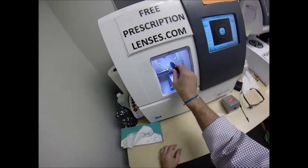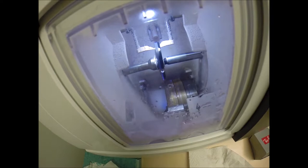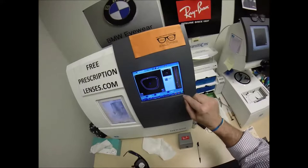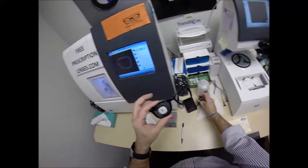Now that the right lens is in, I'm going to flip that over to L, press that on firmly, and just go one step smaller. The door closes, the clamp shuts. The lens is going to be traced by two white styluses. It's going around tracing the left side to know where to place the bevel. You have the least amount of edge thickness showing — even though I moved it back, part of that is I don't want a white ring around the lens from the safety bevel. If any portion of the lens sticks out from the front you can see that, so I make sure it's recessed.